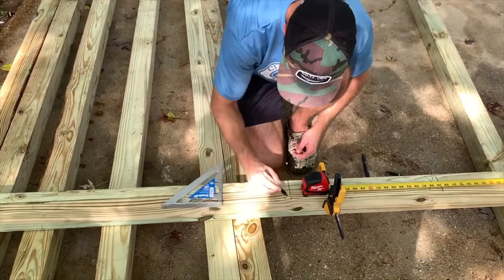Then take 1.5-inch exterior rated screws and mount the window to the shed by going through the window flange perforations and into the rough opening studs of the window. In my personal opinion, I don't think you need to install a screw in every single pre-drilled perforation in the window's mounting flange, but it's always good practice to follow the manufacturer's recommendations. Continue to go around the window flange, installing screws through the flange and into the window's rough opening. Repeat this for as many screws as you feel is necessary.